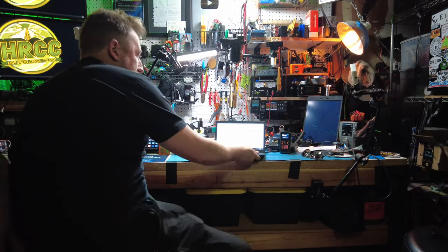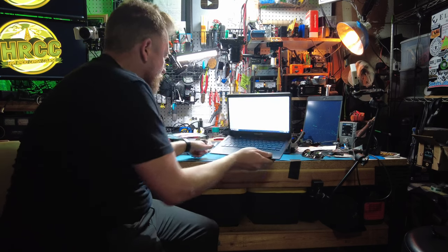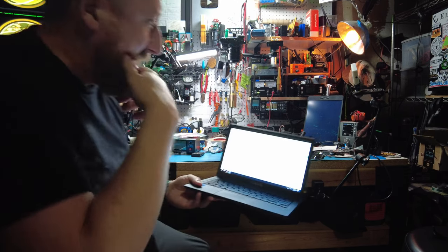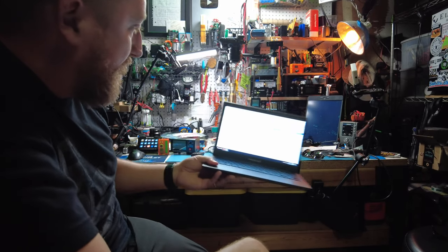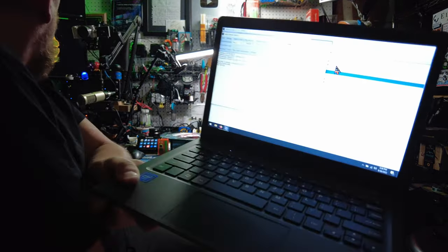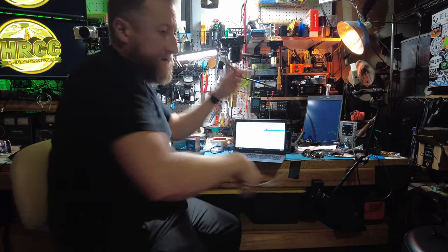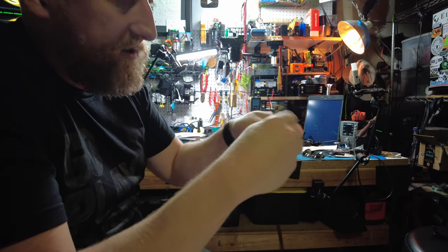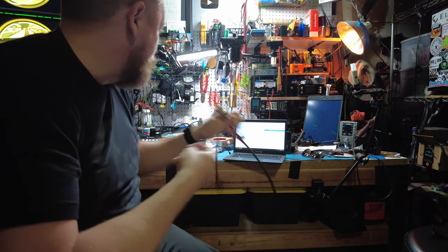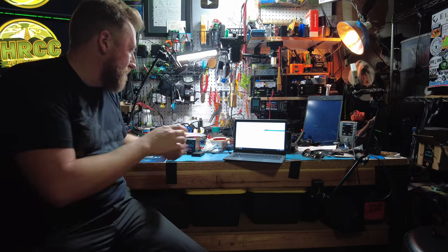Okay, took us a second here. I suspect I might have a bad coax jumper. But we got a connection now. We should be connecting to the gateway. So this coax jumper, I removed it, particularly this barrel connection here. Works fine. Working.